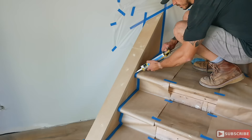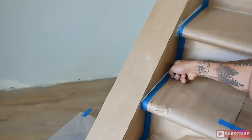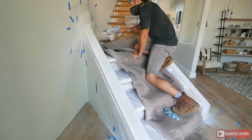When it comes to painting, the second piece of advice when working with MDF is that you have to prime it first. What a lot of people do — including what I did — is just put extra coats of paint-and-primer combined, but MDF ends up sucking it in like a sponge the first couple of coats and you see it transparent through. To save yourself, put one or two layers of primer down first and then you'll only need one or two layers of paint.